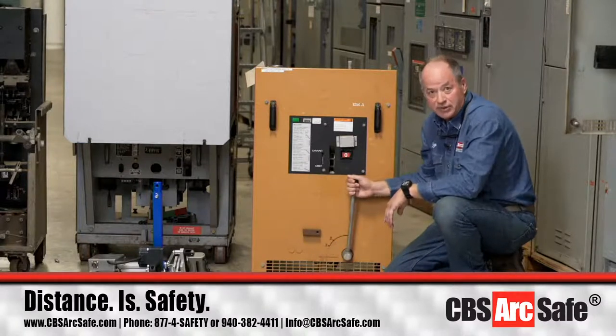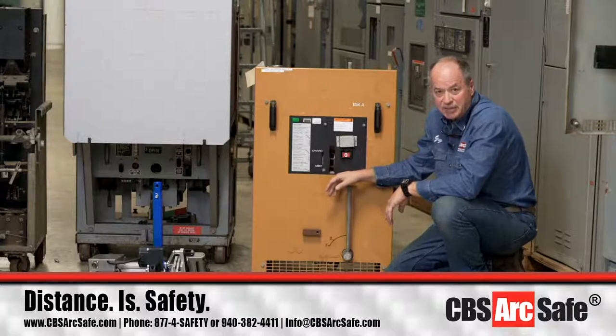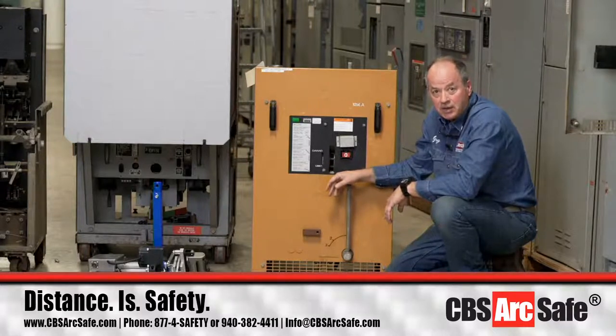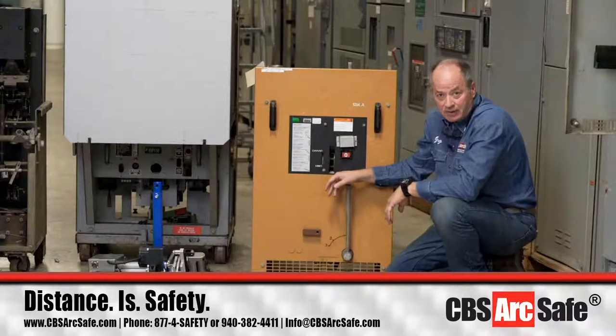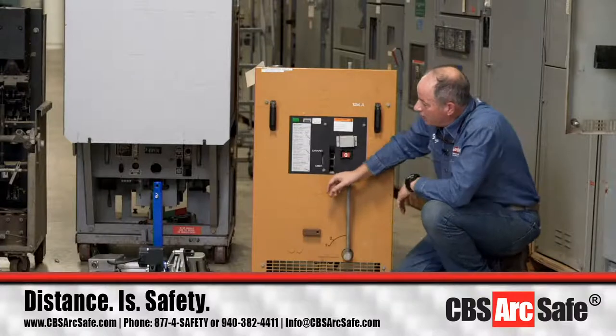Once you have it to the number two position, you move this again to the number three position so the circuit breaker can be removed from the cubicle. For racking purposes we normally just go from one to two and pull or push the circuit breaker. When pushing back in, you push until you encounter resistance at number two, then a motor mounts here and replaces this handle with a rod through the interconnect to pull the breaker onto the bus and complete the racking operation. Siemens makes the 8BW series, which we've encountered in the Middle East and Australia, and we've developed a racking system for that as well — it's similar in terms of the floor track operation.